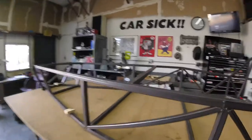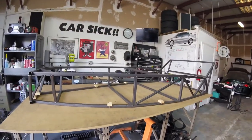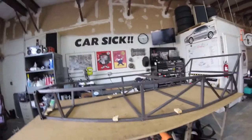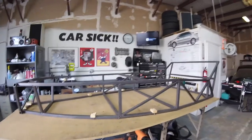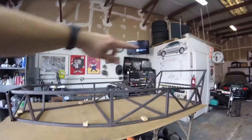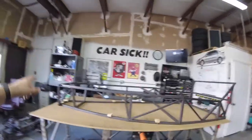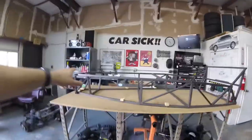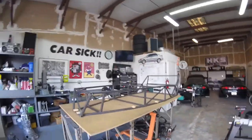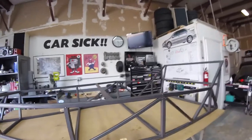So what I think I'm going to do now, and I really wasn't super wanting to do this yet, but I think I might start welding what I have here, so I can take it off here and be able to flip it a couple times as I'm welding. I'll jump around so I don't heat one spot up too much. So I'll weld over here, weld over there, flip it back and forth, working around. But I think right now I'm pretty good with this stuff so far.